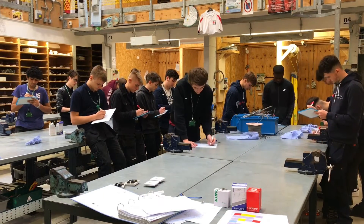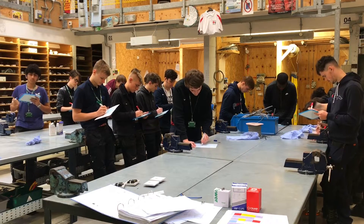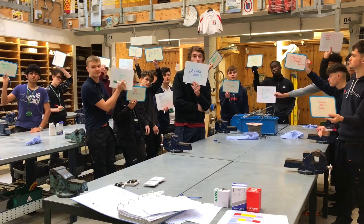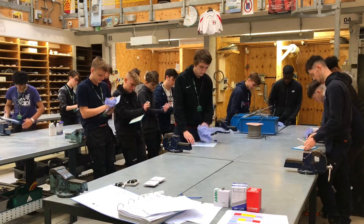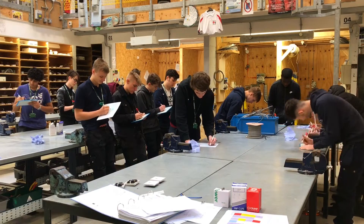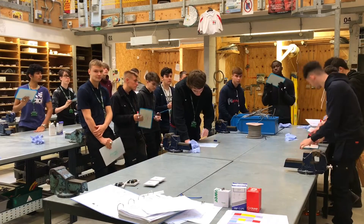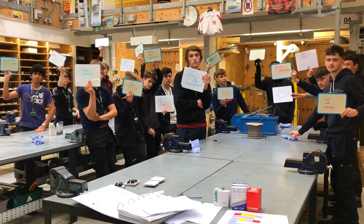Can you name the main switch in a consumer unit? We don't call it a 'main switch' in a consumer unit — what type of switch is it? Nice and quick. Flash! Is that right? Congratulations — double pole switch, brilliant! Which two conductors did it turn off simultaneously? Nice and big with your writing. Hold them up — good answer: line and neutral, brilliant!